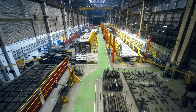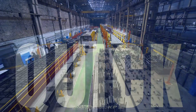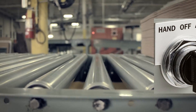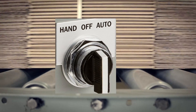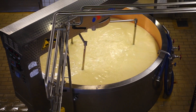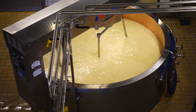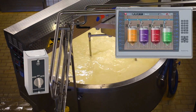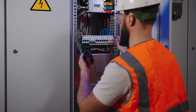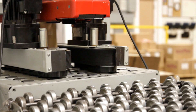Want to learn how to get your 750 series drive working with an HOA switch? A three-position switch aligned for either local or remote control of a motor is a common sight in many industrial facilities. Said switches are referred to as hand-off auto switches, or HOA switches, and allow a drive to be controlled by two different sources. Legacy drive installations included a circuit that provided two three-wire start and stop signals simultaneously to the drive to accommodate the use of HOA switches.